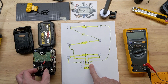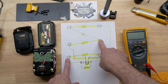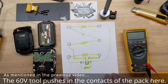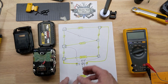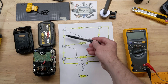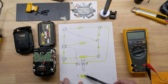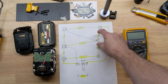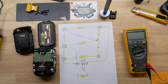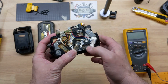We get 60 volts across our terminals based on going through here and then being in series with this set. The contact closes with this set and there's 60 volts. Before, I drew it all together and looking back at the video it got a little too busy, drawing all the normally closed contacts in there as well, like it is in the 20-volt setup where these are opened up and we're simply putting all the plus side and all the minus side together in parallel, giving us 20 volts at six amp hour instead of 60 volt at two amp.